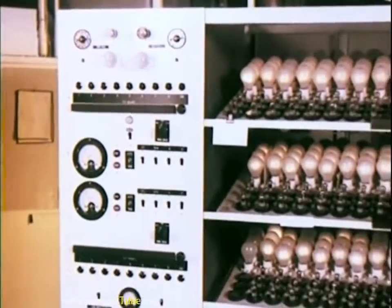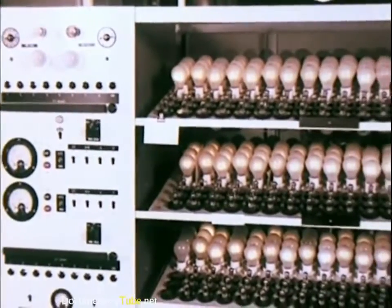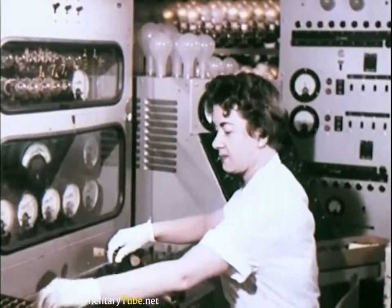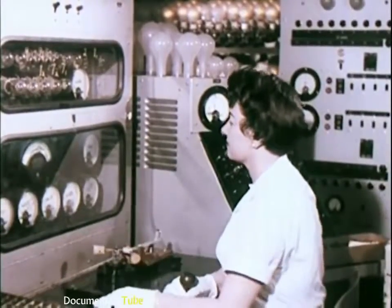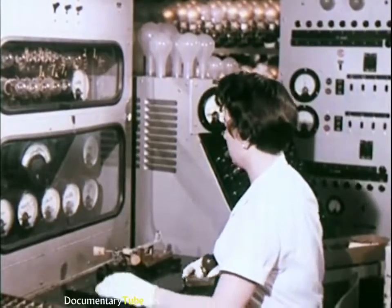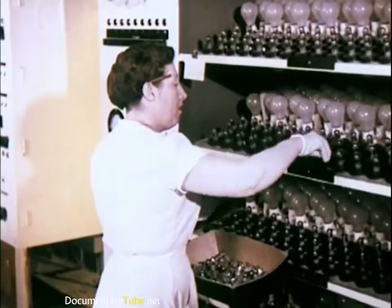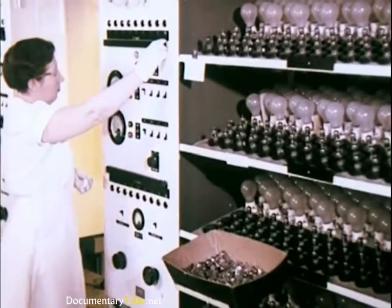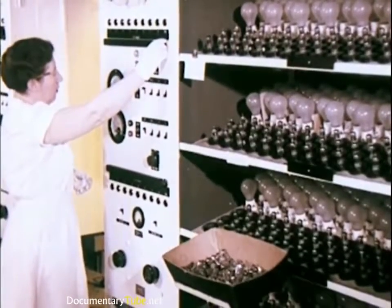After manufacturing, every tube is aged in racks at 3 to 4 times rated filament voltages, and then 100% tested for operating characteristics. When packed, each lot is coded to identify them in event sampling checks reveal deficiencies.